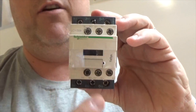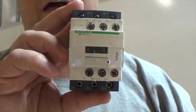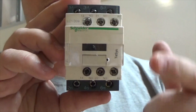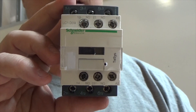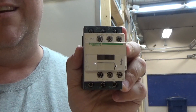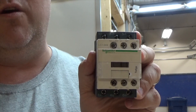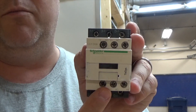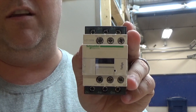When we look at the front, you can see we have the front three screws. Here and here is our A1 and our A2, meaning our hot and our neutral can go here — that is basically what's going to be pulling in our power. This is a 120-volt coil, so we'll put 120 volts here. If it were 24 volts, this would be a 24-volt coil. Make sure you remember what the control voltage is so that you install the right type of device, because if you put 120 volts to a 24-volt coil, it's not going to be good. The middle pair is like our switch — that is our normally closed. And the outer pair, completely opposite of our A1 and A2 coil, that's our normally open. Today we're going to hook up the coil, normally open and normally closed, which will be our green light and red light, hook up this control relay, pull it in, and turn our lights on and off so you can see how it works.